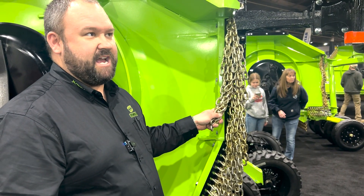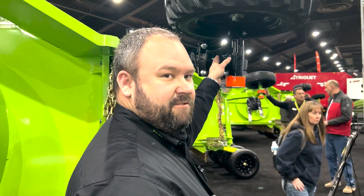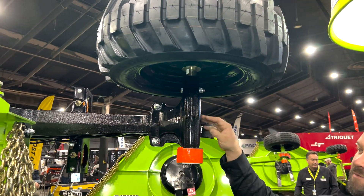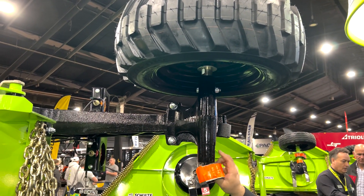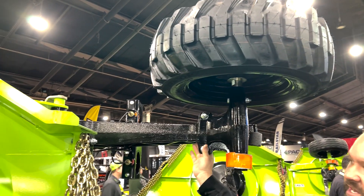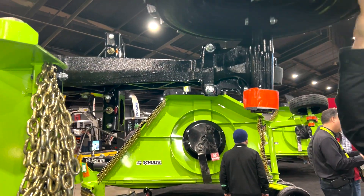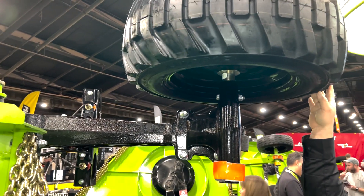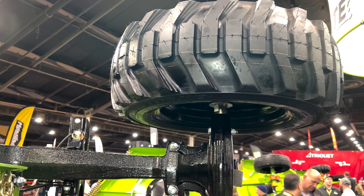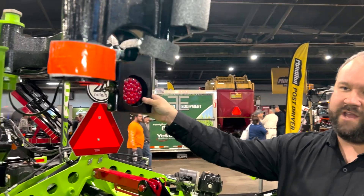Double safety chains are standard on here, as well as many different options for the wheels. The safety light kit comes standard on the outside of the wing wheels. Tire options include the new skid steer tire, as well as foam-filled, aircraft laminated. You can also go with a dual axle or wing walking axle configuration — this is a cast assembly with the option that can be changed out.